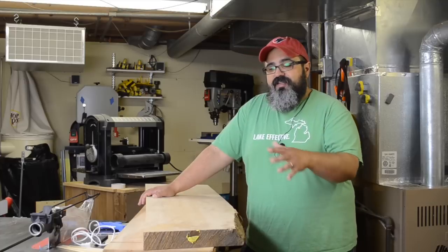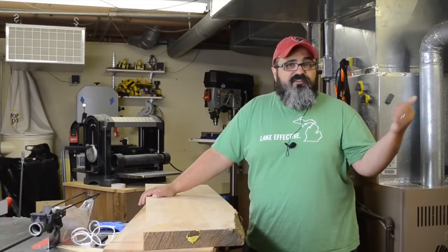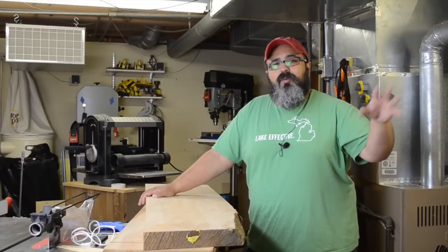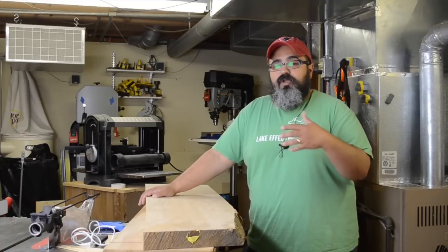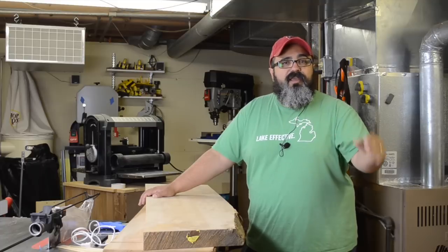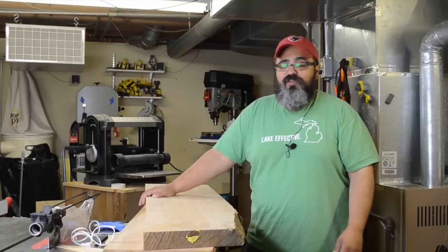There are a couple of techniques I could use so that I could put it on my jointer to flatten one side and then run it through my thickness planer, or I could just head over to the bench and use my hand planes. But what I really want to do is use my thickness planer and a thickness planer sled to make quick work of getting one side flat, then flip it over for a parallel edge, and get these to their final dimensions for the wife.